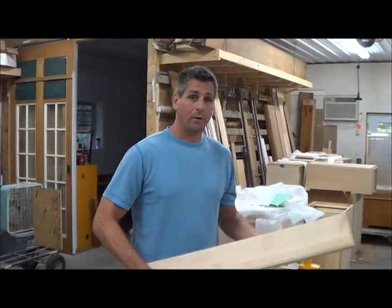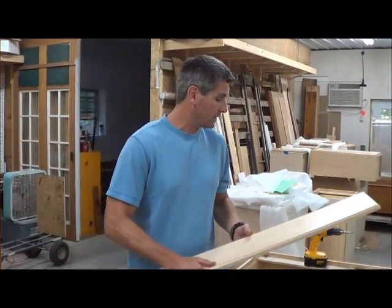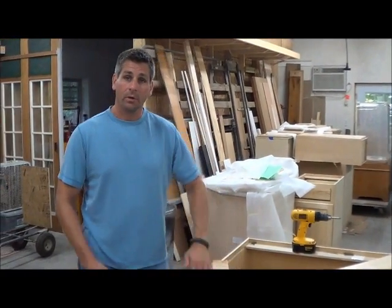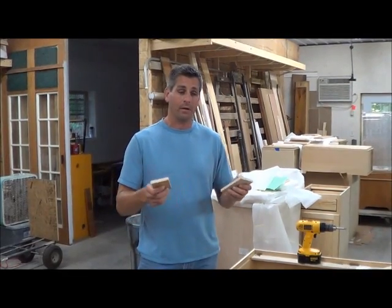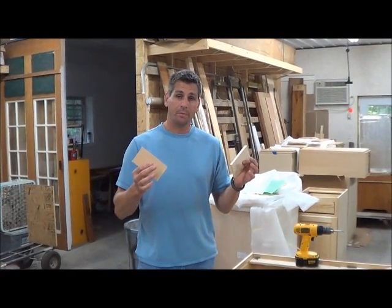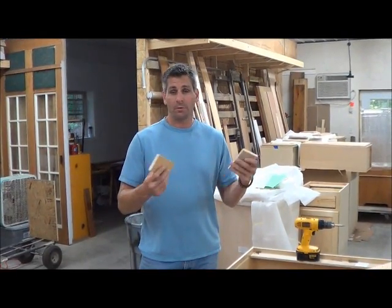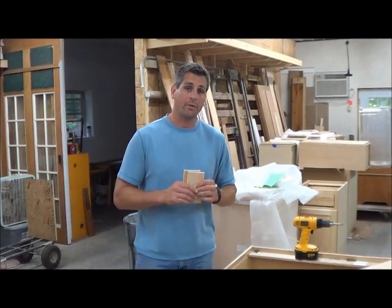Unless you're doing a tip-out tray, in which case that's self-explanatory and will someday be handled in a different video, you're going to want to mount that drawer right to the cabinet face. We're going to talk you through how to do that, but what you have to know is every sink base cabinet comes with these two little 3x5 pieces of half-inch plywood blocks. Looks like scrap. People open these boxes up all the time and say, oh, I don't want those. You do need these, and we'll show you how they're used right now.